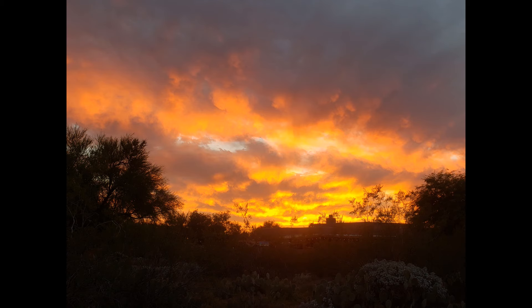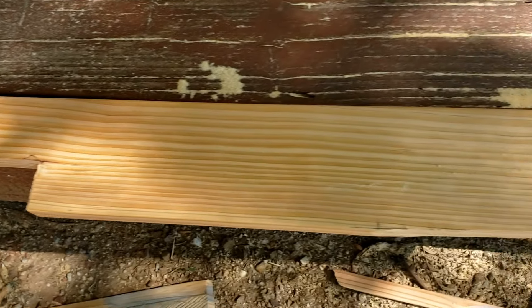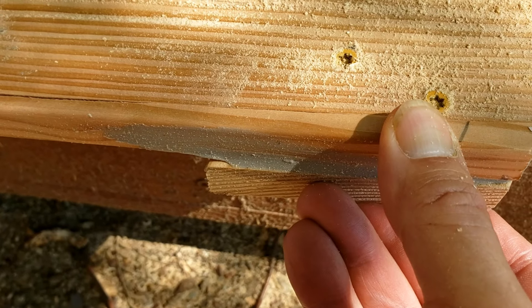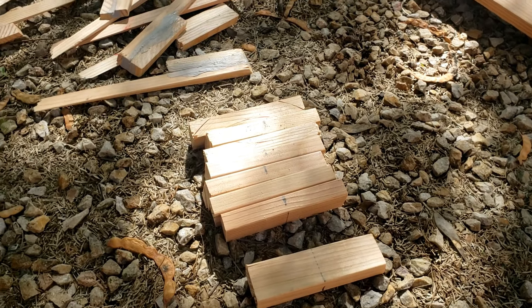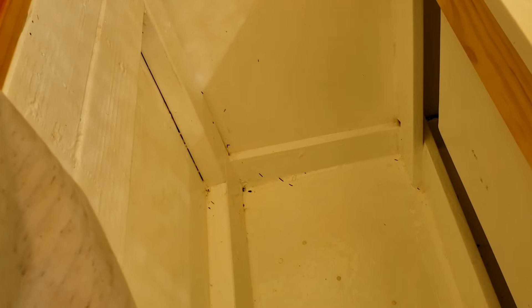These plans are for a flat bottom boat. Typically you have water drainage cutouts at the keelson, and the water drains towards the back of the boat through these cutouts. I decided to try something on the fly to help the water drain away from the sides of the boat towards the keelson — to put a slight angle on the floor towards the center. I cut a continuous wedge starting one inch high on the end and extending it 14 inches towards the center keelson notch. Here you can see the frames after being cut; they have a very slight bow shape. Jumping forward, you can see the water running away from the sides like I had hoped, so I'm happy with the decision.